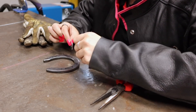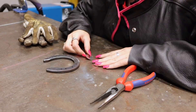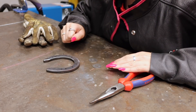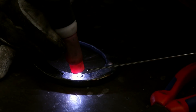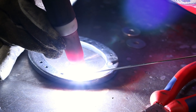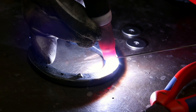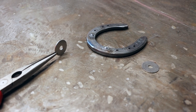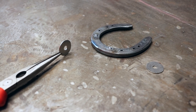The first thing I'm going to do is add the washers to the horseshoe to create the eyes. The easiest way I find to do this is to add some filler rod to the horseshoe, then get some pliers and just fuse the filler rod off of the horseshoe onto the washer, as they're different materials so they take different heat. I've added two blobs of filler rod to the steel horseshoe, and I'm now going to take my pliers and washer, heat the filler rod up, and fuse it to the washer.